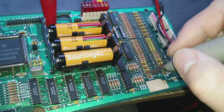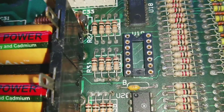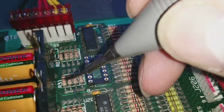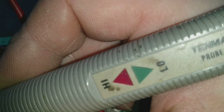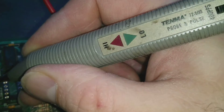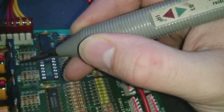There's a pull-up resistor somewhere, so I'll just check the schematics and find where that is and replace it. I've found the resistor — it's actually in the corrosion zone, so that could have been part of the problem. One side is high, and the other side is floating — high, floating — so that resistor is open. I need to replace that.